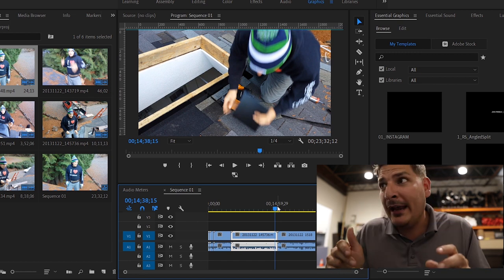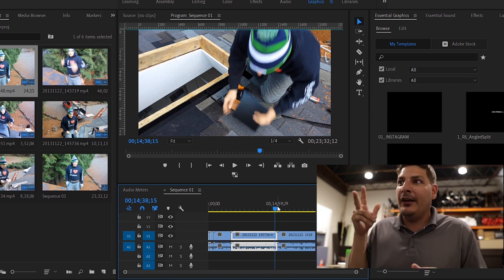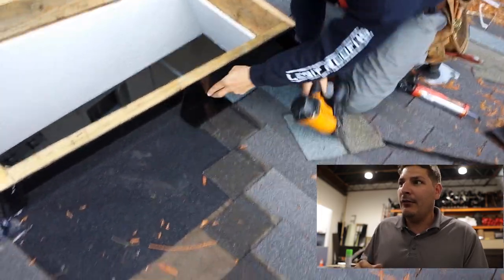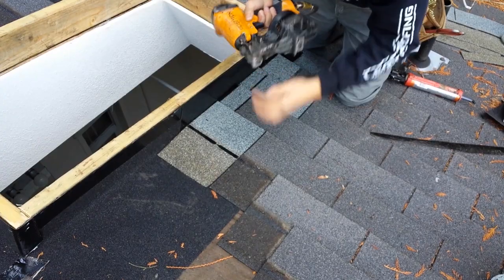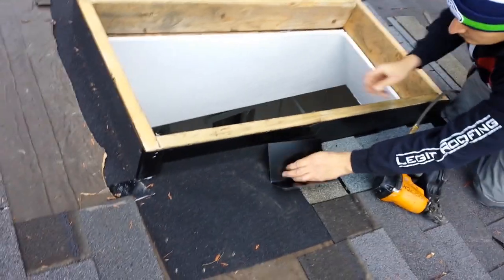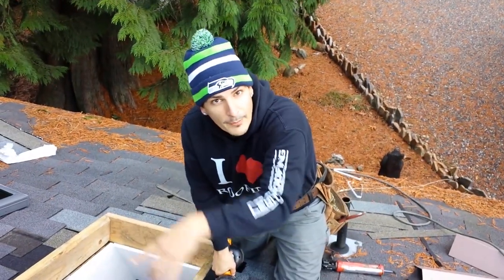Sometimes if you overbend it or underbend it, if you look right at the top of that skylight, those are bent within like an eighth of an inch because I bent this metal. I can't even count how many skylights. So I know exactly where to bend it, but just watch how fast I pulled it out. Look at that, it's perfect. Do you feel how hard that is, babe? You got a gauge on your gun? We can use the gauge too. Not over bent, not under bent, every time. We'll do the other side and we'll show you guys how to do the back band.